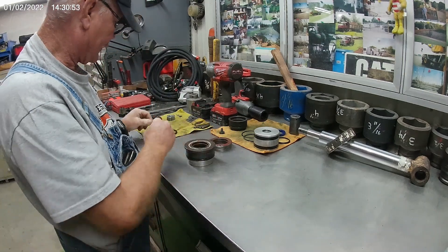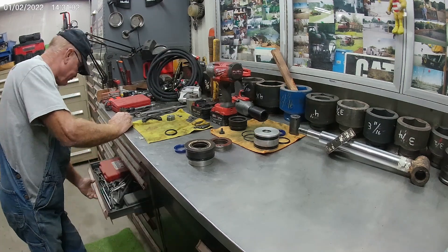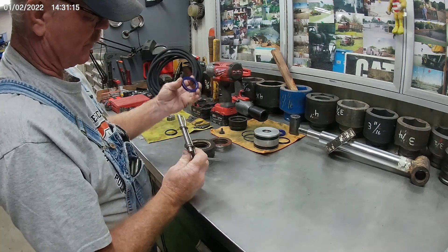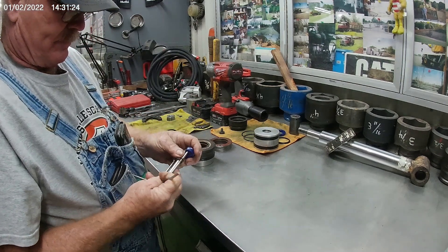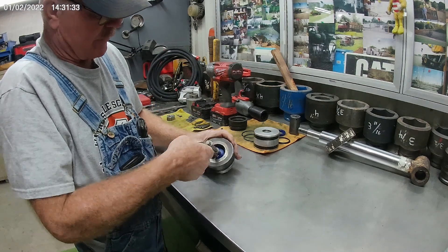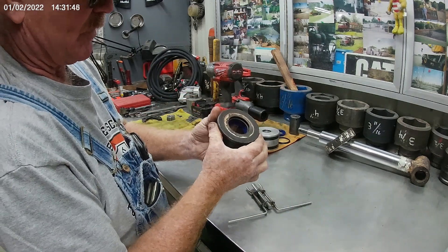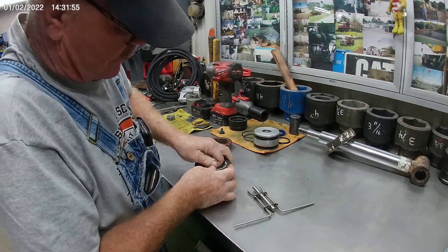The next one we're going to put in is the U-cup. Here's our new U-cup and it's stiff, so we're going to need a U-cup tool. The open part — the U-cup part — always goes down. Put it in there and wind it up. Once you get it all wound up, go right down in that groove and let it unwind — and it pops right in there. Next we're going to put in is our dust wiper. It just sets in the groove — bend it around and push it in like that. There's the head gland done.